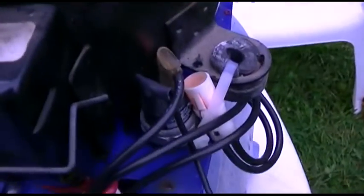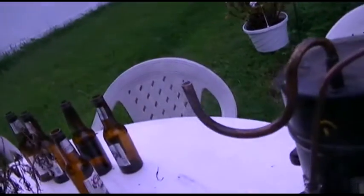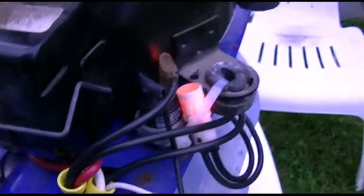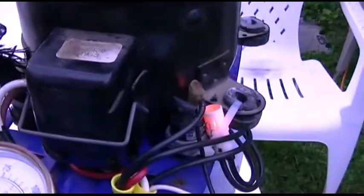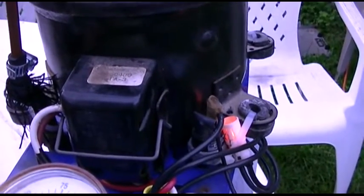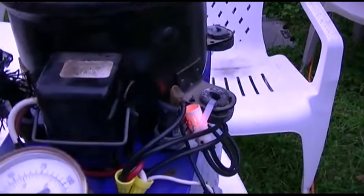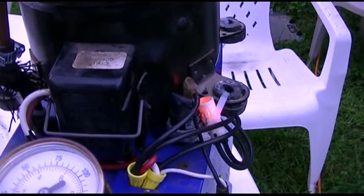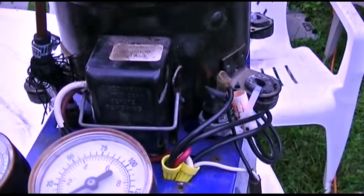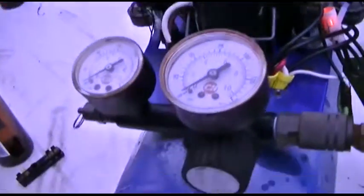If I drain it enough, it can't start. Now what I have to do is run it all the way down. It still says on because that pressure switch says on. And as soon as the compressor cutout kicks back in, it'll restart. I'll just hold the valve in case. And it restarts — everything's fine. It'll fill right back up.